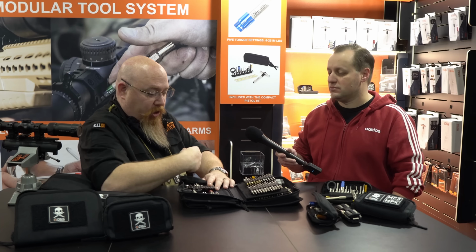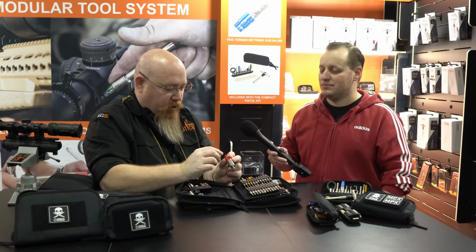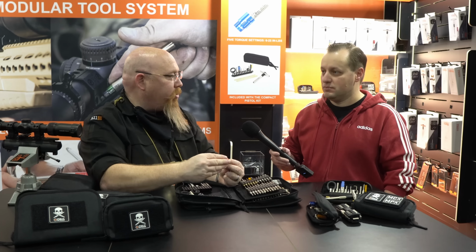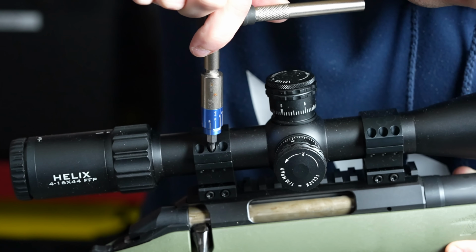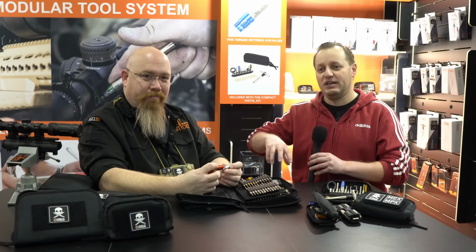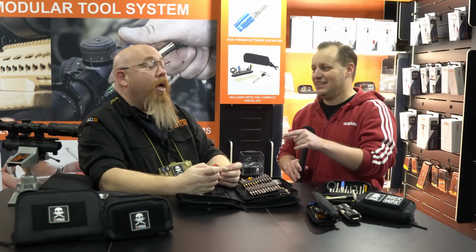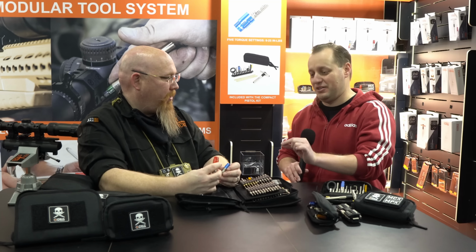And just to touch on this, because some people do have some confusion when it comes to our all-in-ones: these are not something that you set. You don't turn it to a torque value. There's a very small line that you will then turn, and the barrel will rotate as a beam torque wrench would. And that's how you get to your set torque value. For those who don't understand it or who've never used one of these, I will include a video after this showing it rotating when you properly tighten it up. And the other note is you do not use these to unfasten fasteners. This is only to fasten them and to verify the torque value.